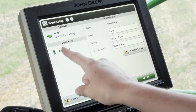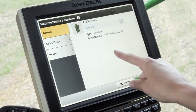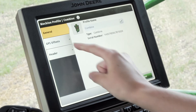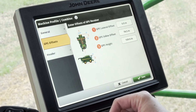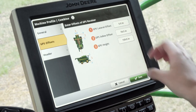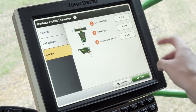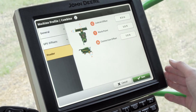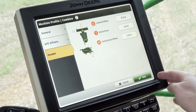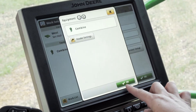Next, click on Equipment. In here we're going to verify our combine. The first tab has our profile name and serial number. Then we verify our GPS offsets for our combine and our header. On the Gen 4 displays, those are often pre-loaded in, but we always recommend getting out a tape measure to verify they are correct. Once you've confirmed the combine offsets, push Save, then go over to the header and verify those as well. It's always good to use a tape measure to verify the correct working points. Once all machine profile offsets are correct, select Save and OK.